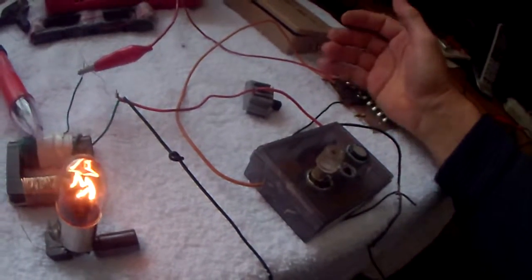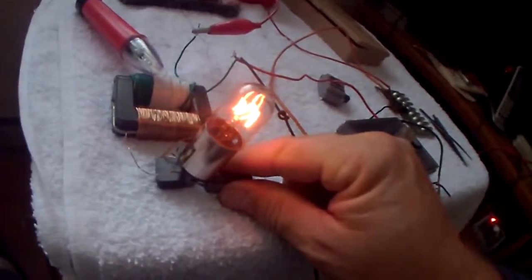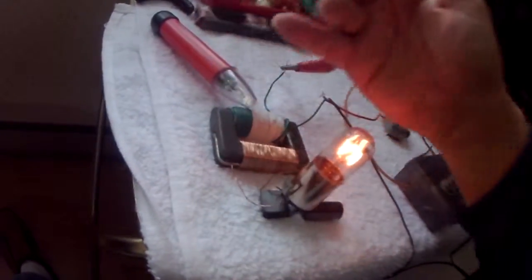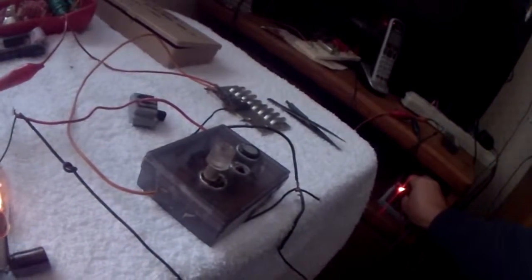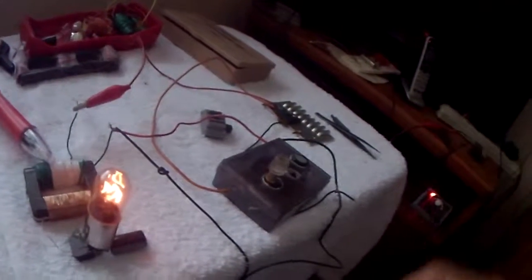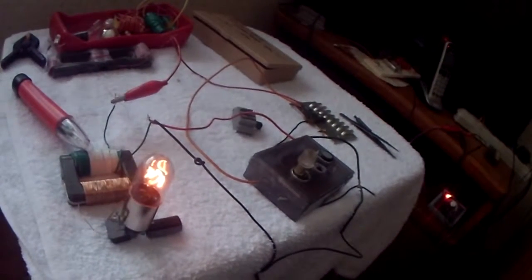It's getting pretty warm — not hot but getting there. Even this cap gets hot, so it's not at its working voltage; this really gets warm. The oil stays cool though. It's running off a 15 volt power supply over here, adjustable, at about 17 volts cranked up. If I crank it down you'll hear the frequency go down with it. It's just beyond hearing range — about 10 to 15 kilohertz maybe.